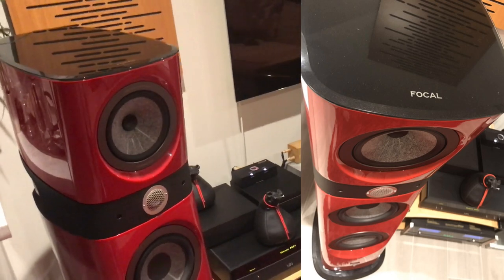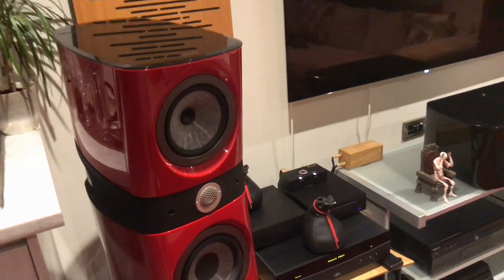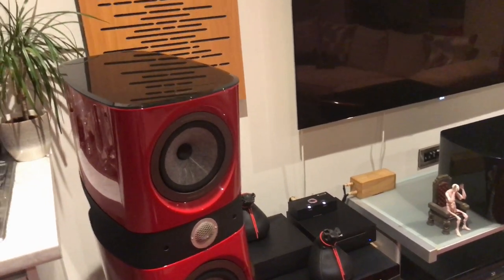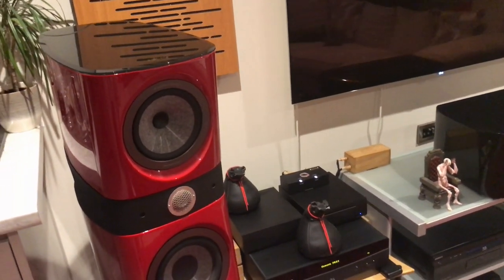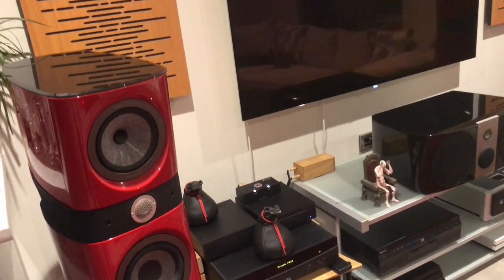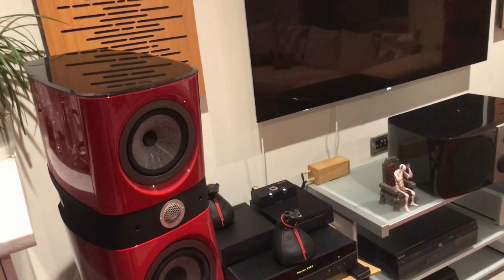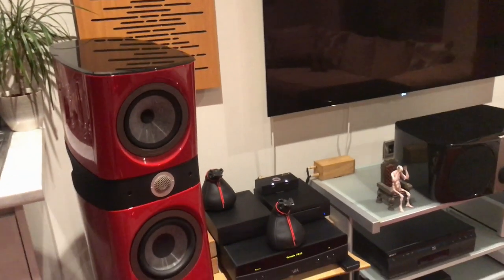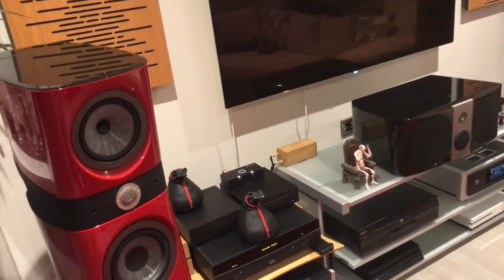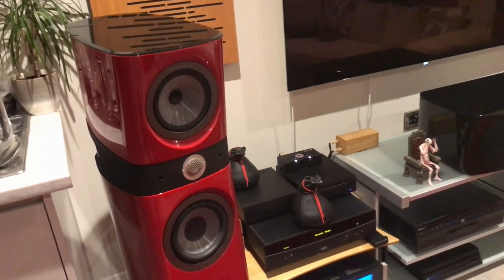One of the main reasons I chose the Sopras is they're very cohesive — they're able to disappear and project a kind of 3D holographic sound into the room with front-to-back depth and a huge soundstage. The beryllium tweeters are extremely detailed; you hear a lot of information in the mix, and if the recording is bad you're going to hear it. They've also done a fantastic job seamlessly blending the tweeter with the mid-range by crossing over at a slightly lower frequency, which means voices like Leonard Cohen sound chesty while female vocalists don't. They sound fantastic at low volumes and have a fleshy quality to the mid-range which I really like.